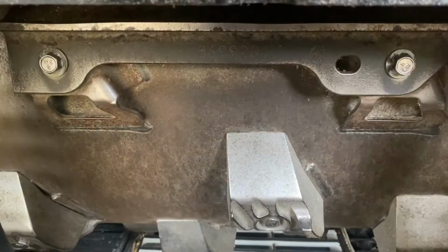So when I add extra spike teeth rasp bars to the back of the rotor, I'm adding 8 extra spikes, and those 8 extra spikes help agitate that crop mat more, which helps shake your grain out of the crop mat. And green tough beans, they help keep that crop mat moving through the back of the machine. And if you're in corn, they help rip those shucks apart, get any grain out of the shucks in the back of the rotor. So we'll take a look at how we're setting them up on the rotor.